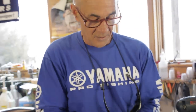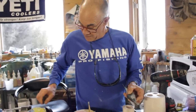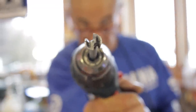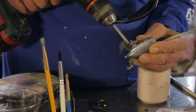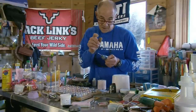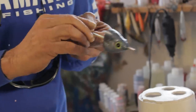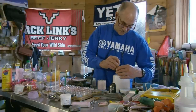After we've pulled this out, I don't have to clean it up much, but I said I wanted big eyes in it, so I'm taking a special type of bit called a Forstner bit. It's made to drill a nice, round, flat-bottomed hole. And as you can see, it makes a nice little hole. I've cleaned off the flash — that's the excess from the other mold — and glued my eyes in. I've got a pin through it, and now I'm going to stick it in our mold and pour some clear resin around it.